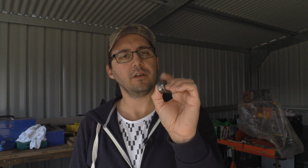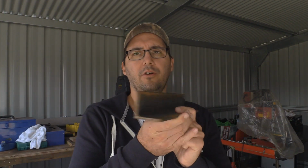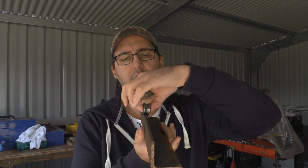last week at some stage, so we're going to be using those, because these are a 120 degree V bearing. They're designed to run on round bar or round edge, and I could possibly get away with running, if I used a piece of angle, I could run it like so, but I didn't quite like the idea of having to clean up all the mill scale and so forth.